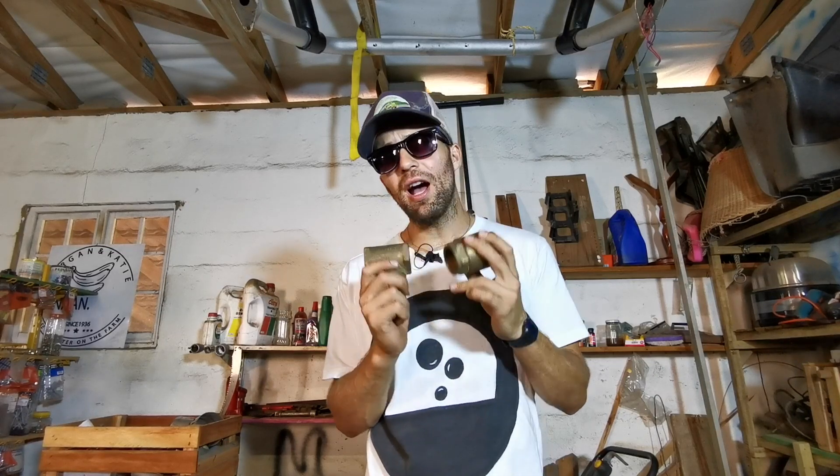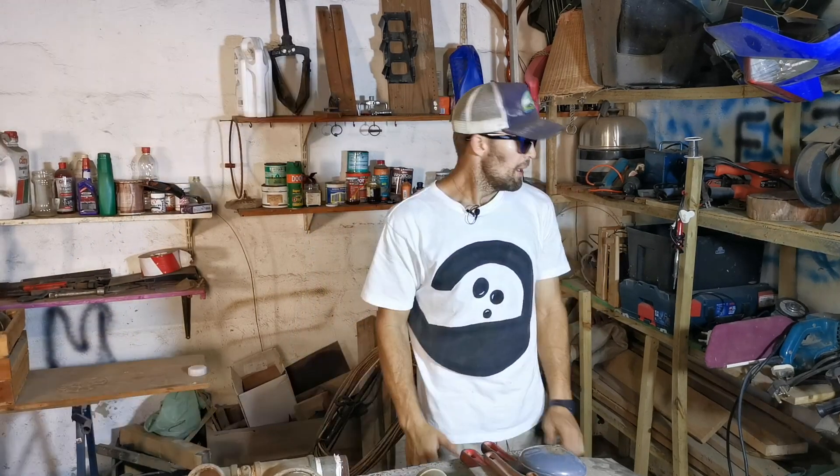The moral of the story is that these off-the-shelf spring check and swing check brass valves do work, but if you have a high-powered system they won't hold up. Rather than waste your money on all these parts, take my advice and start making your own valves — I show you how in my ultimate ram pump video. It comes down to your goals: how much water you want delivered, your head height, and how much head is coming onto your ram, because that determines the shear forces on everything. Thanks for joining — if you enjoyed it, hit subscribe, the notification bell, and give it a like!